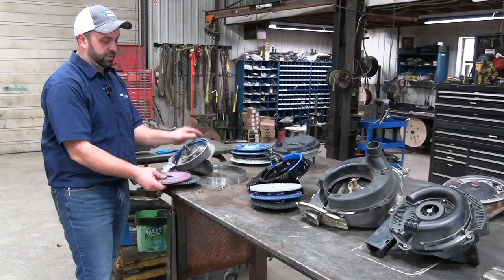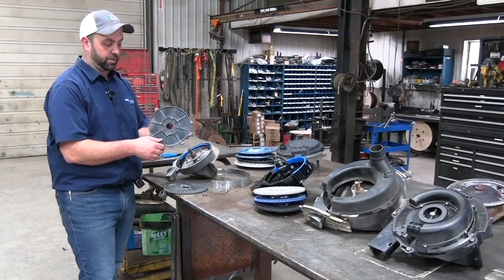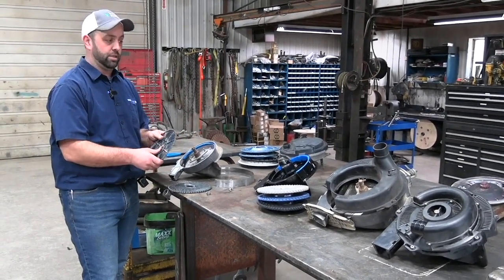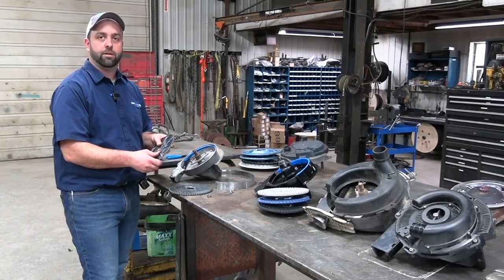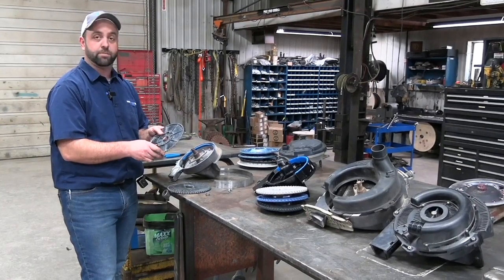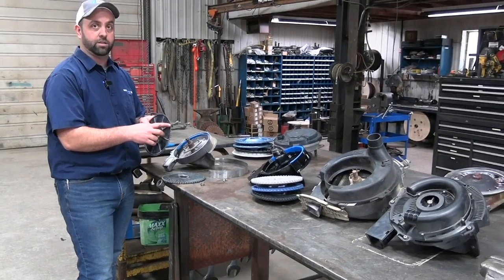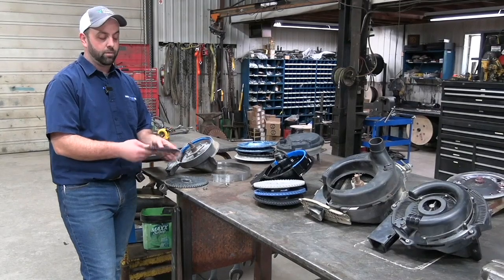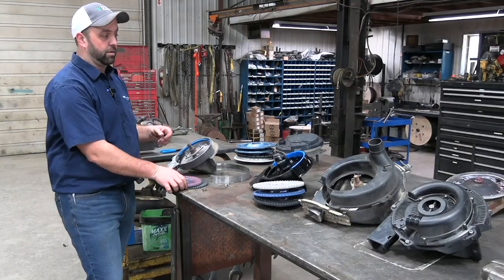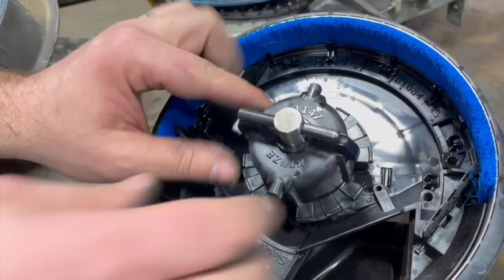The main thing I want to talk about: we have our classic black plate and our classic blue plate. The blue plates are for 1,400 to 2,200 seeds per pound, and the black plates go from 2,200 up to 4,000 seeds per pound. What happens when we're on the cusp of that — near that 2,200 seed per pound mark? I've experienced this personally: some of the bigger ones in that mix get stuck in our smaller plate, causing a skip every time. And when I go to the blue plate, all my smaller ones make doubles and my population is high.